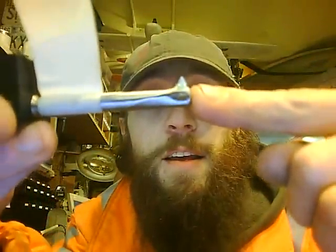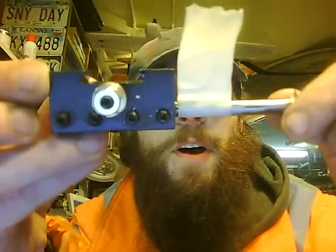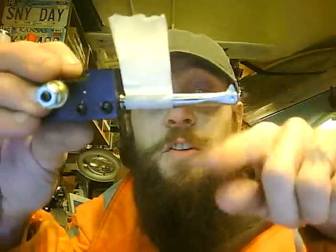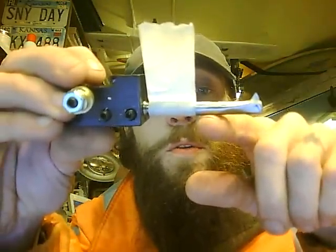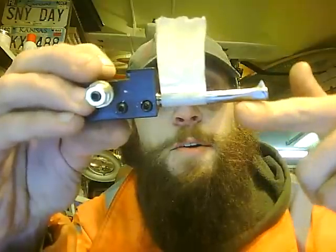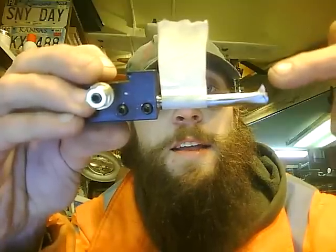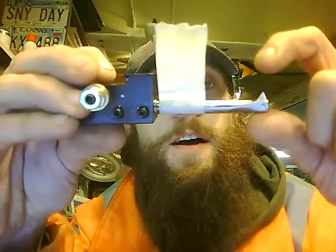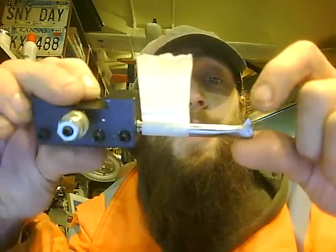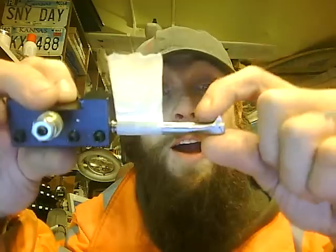That's the threading tool — the internal tool. It's on a boring bar holder, and it's just cheap cold rolled steel that I turned down to fit in there. Then I turned it down to a smaller shank, drilled it sideways, and inserted a round piece of good steel.